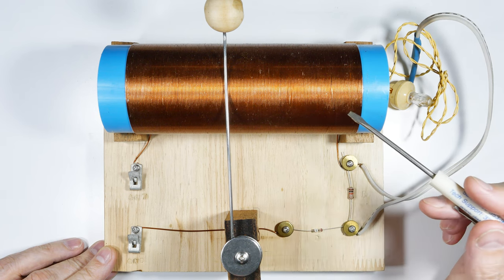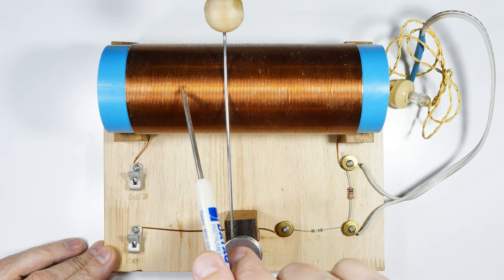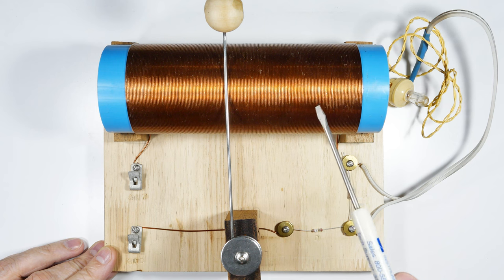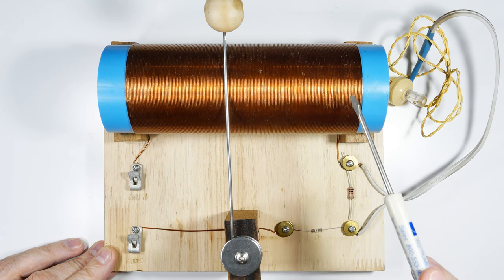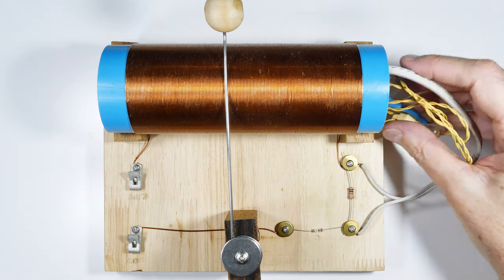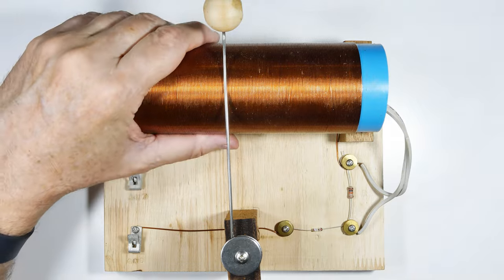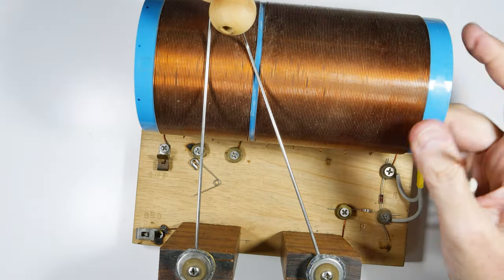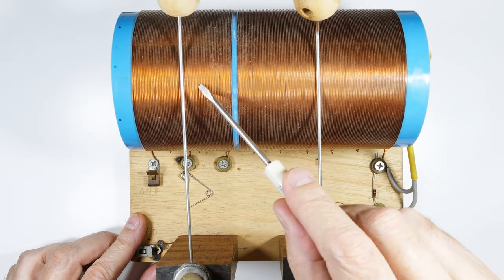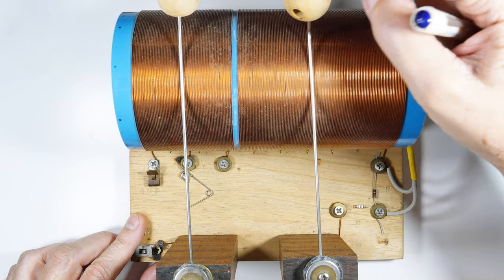This is obviously a wiper version of a crystal radio, and this one does not have a separate circuit for the antenna ground, which makes it susceptible to being overwhelmed by a strong signal. But otherwise it's a very good, very simple-to-operate crystal radio and also very easy to build and very low cost — most of this is just scrap stuff. The next step up from that is a crystal radio that has a separate tunable circuit for the antenna ground, and then a separate tuning for the actual station.